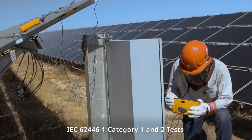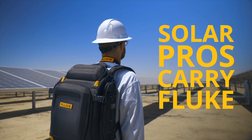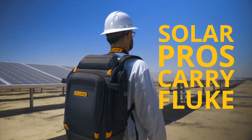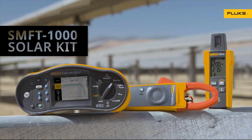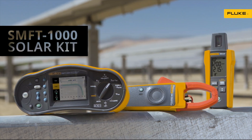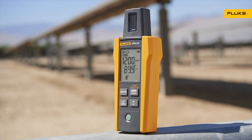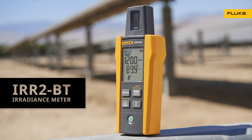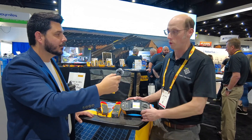It will check voltage and polarity, open-circuit voltage, and short-circuit current. It will also test power. There's a current clamp and voltage probes that come with it. You set those up on the DC side, measure the DC power, and save that in the instrument. Then you move the clamps to the AC side to measure AC power. From there, it actually calculates inverter efficiency, so you can see how efficiently the inverter is operating.